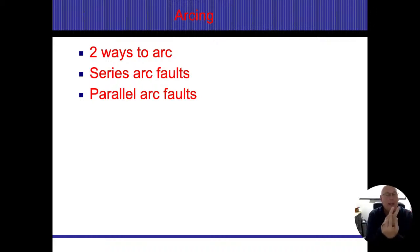Whereas a parallel arc, that's going to be between my energized conductor and my neutral conductor. And this is what we mostly see. When they start getting smushed together and getting close enough together, they're going to want to start creating a short circuit or a phase to neutral fault. So how does this happen? We have conductors, we have insulators around the conductors, and with extension cords, I've got two conductors, both of them have insulation, then another sheath that wraps the whole thing together. If I keep standing on that sheathing and I just keep squeezing it and breaking it, over time I'm going to be damaging the insulation on the conductors themselves and the sheathing as well. And if I just keep squeezing it, and it gets weaker and weaker, electricity is eventually going to want to start making its way through the insulation once it gets damaged, and it's going to start creating a parallel arc at that point in time.